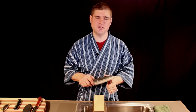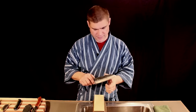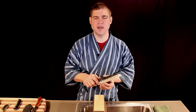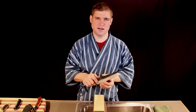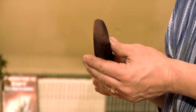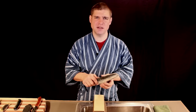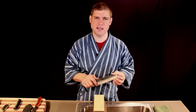That's what allows you to do this test in complete safety and peace of mind and get the most accurate feedback. Then you're going to take your first 3 fingers and put them together, and ever so gently put them on the blade of the knife, right on what we call the primary edge. That's the part that initiates the cutting in a blade. Now, you're not going to try to stroke your fingers back and forth, but rather slide your fingers along the cutting edge of the blade. You're going to check the heel, the belly, and the tip of the blade.